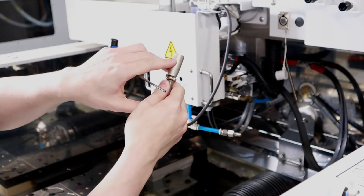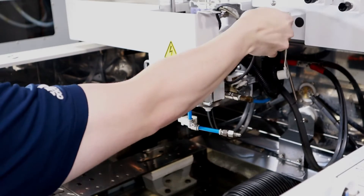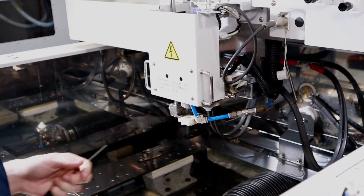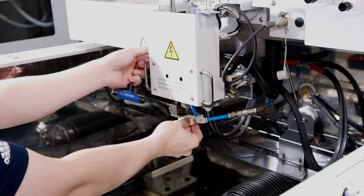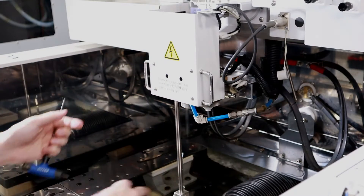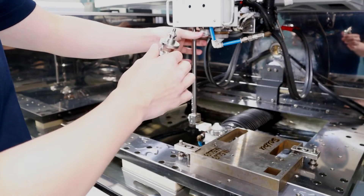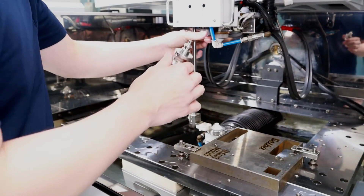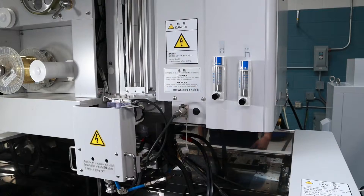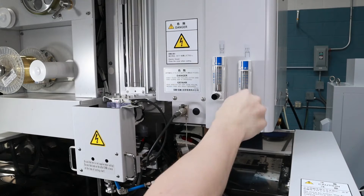On this line here, there's an arrow pointing at basically the top of this piece and also what direction it goes in. Pushing it in, you should hear a click. This quick release flushing line gets unplugged and connected to our SHM. There's a black holder on this side that we loosen to lower the retaining arm so that we can load in our electrode. We insert it here at the top — this is a quick release — so we push this up, insert our collet, let go, and it's ready to go. Now we open the flushing on the upper head, turn it all the way, and then close off the flushing going to the lower head.